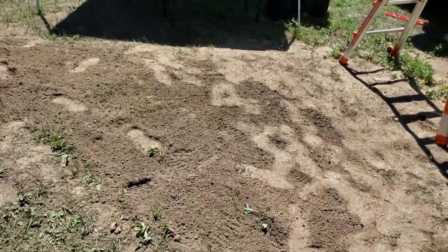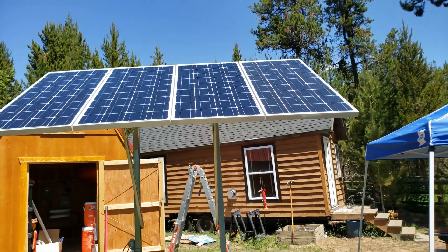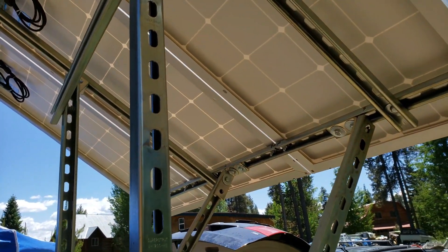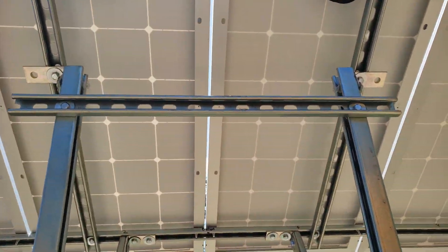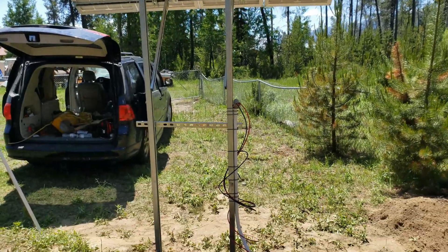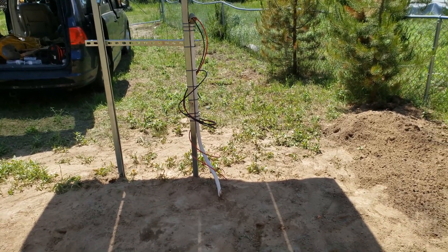Okay, this is another update. I spent a lot of time on this solar array — it's up, it looks really flat, it looks good. But just as I suspected it's got a wiggle, a sort of a twist or torque. What I did is I added a brace across the unistrut and then one at the top where it wiggles more — it's reduced it quite a bit, but I'm worried about a big windstorm causing this thing to really move. If it becomes a problem we'll have to figure out another way to brace it, or maybe have a third leg go into the ground.